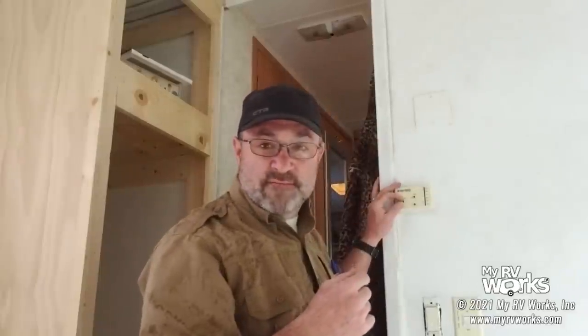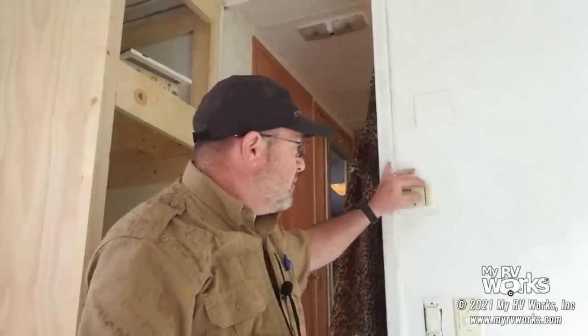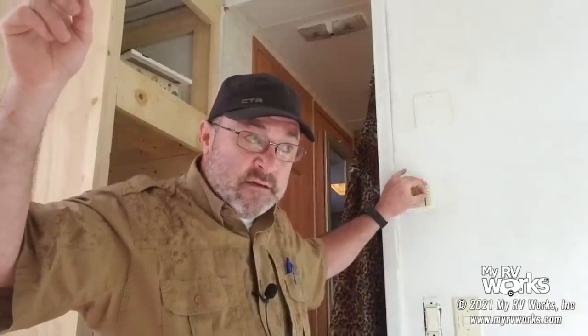When I put the thermostat in furnace mode you hear the click up top — it's very audible. The next click you should hear is down here where the furnace is. I have not taken a single tool out of my tool bag yet. I'm just using my eyes and ears — that's my best tool. If the thermostat is set down to 40 degrees, for example, and you're on furnace, you probably will not hear a click. I bring the slider up and right at about 65 degrees — there it goes — the click.